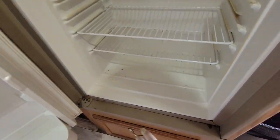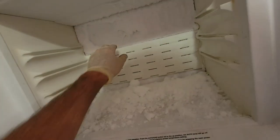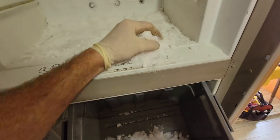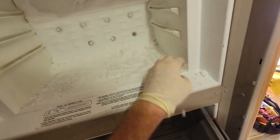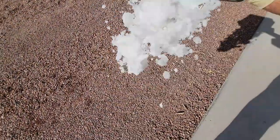So I did already do an inspection in here. Model number 2652, just like he said. The plastic box itself doesn't look bad. He's been adding ice in here and the cooling unit's been going bad, so I've got to get some ice out. But yeah, this refrigerator section is not even cold at all. I was able to get the frost off and move that out of the way. The amount of frost does indicate that it was cool enough in the freezer. By all accounts the door seal has been sealing really well — he says it's actually difficult to open the freezer. But if you do get a lot of moisture in a freezer, it's likely your door seal is bad and it's freezing the moisture from the air getting past it.